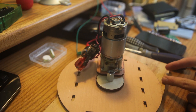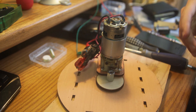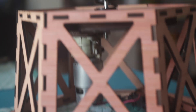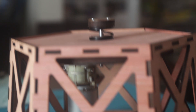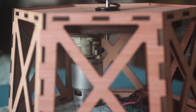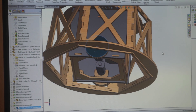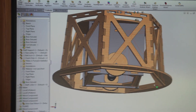Since this motor is only spinning in one direction, we can put a large capacitor across the leads, and that'll help smooth out the voltage across the motor. For simplicity, and because I have to finish this thing in about a day, I'm going to use a wooden wheel with an o-ring as the drive and clutch. I'm also removing the four-wheel drive — thanks to advice from a friend, thanks Luke — who suggested just having two wheels in the center, with some little outriggers to help prevent the teetering caused by only having two wheels.